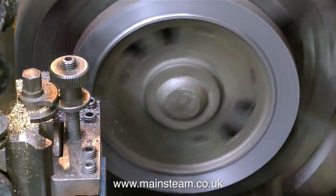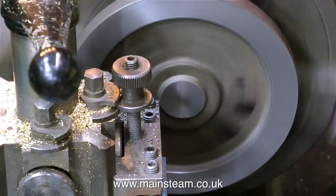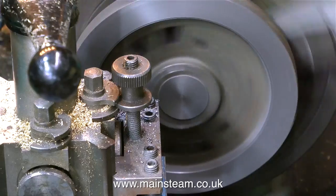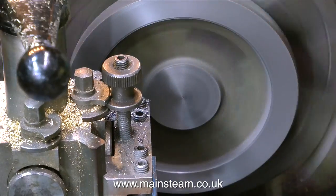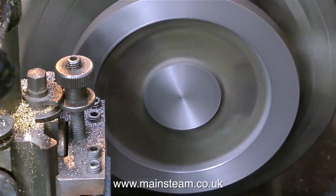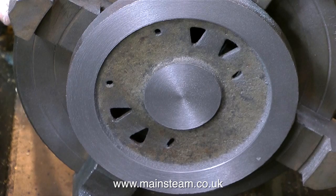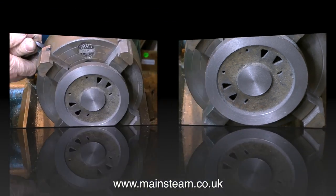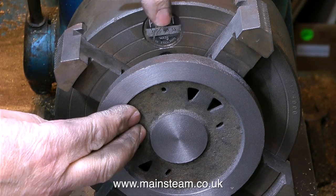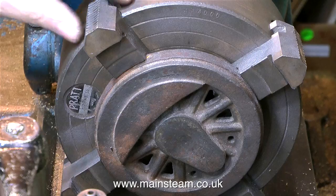There's of course a finished dimension to this wheel, but in this case I'm not concentrating on that because I don't have the drawing — I'm just making a locomotive driving wheel for no other purpose than to show how I do it. A quick note about machining cast iron: this video is speeded up because if I ran it in real time it would be far too long. You need to find a speed that your cutting tool and your lathe will cope with. Cast iron can be very difficult to machine — it's deceptive, one minute it's cutting like butter and the next it's really hard. I'm using a carbide tip tool; machining speeds and feeds will vary relative to the type of machine you're using, and the cutting tool I would use on cast iron is normally a round nose tool unless I have to cut up to a tight shoulder.